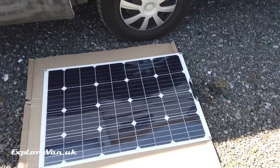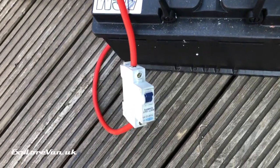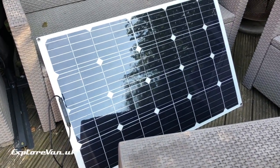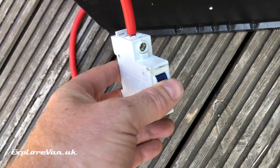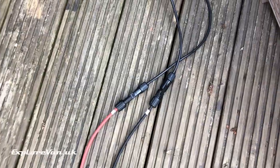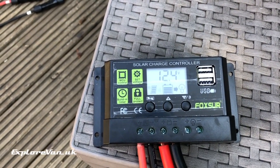Let's take a quick look at the test setup. Here we have the controller connected to the battery via a DC circuit breaker, the battery monitor with a hall effect sensor to see what power is being taken, what is being put in, and the capacity left in the battery. The solar panels are ready to be connected to the controller. It's important to do this in the right order: first connect the battery to the controller to allow it to initiate, then with the panels in the shade or covered up, connect the solar panels.